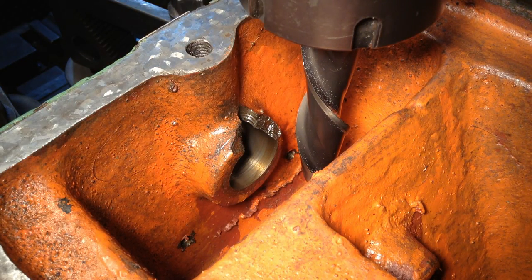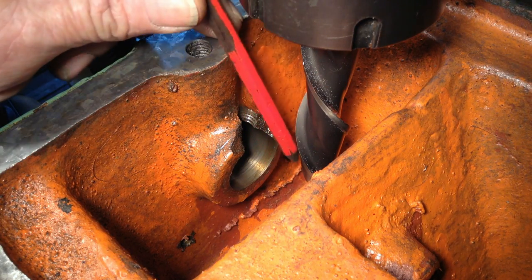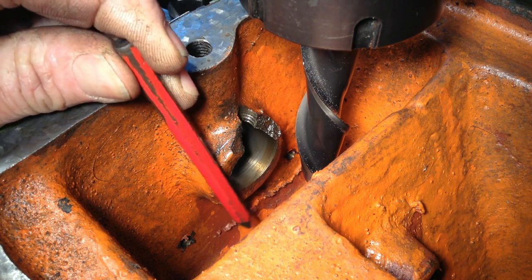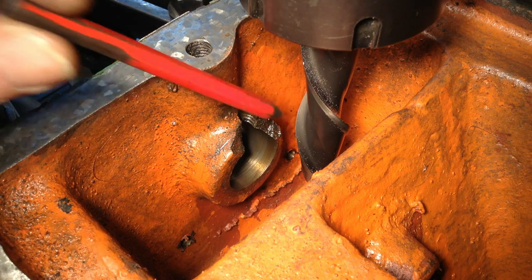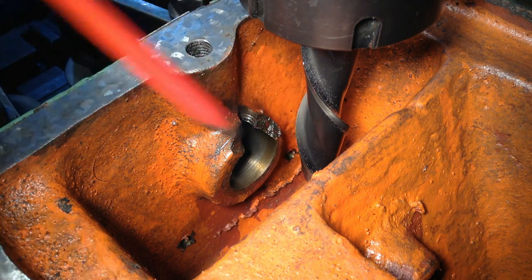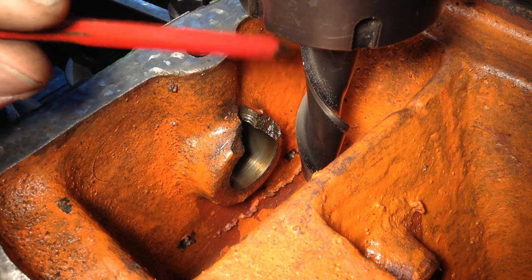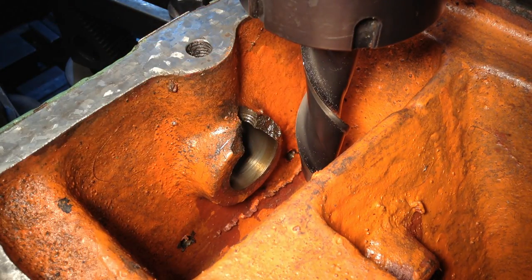And it's very hard to see what's going on, but with the left-hand cutter starting over here, I can see exactly what's happening. Now, if I was to use a right-hand cutter and start from here, I would have to climb mill, and I do not want to do that on this job, as we're only very lightly clamped and it's a long cutter, and things can turn ugly very quick unless you have a really rigid setup, a good setup when you're climb milling. So hence left-hand flute and conventional milling.